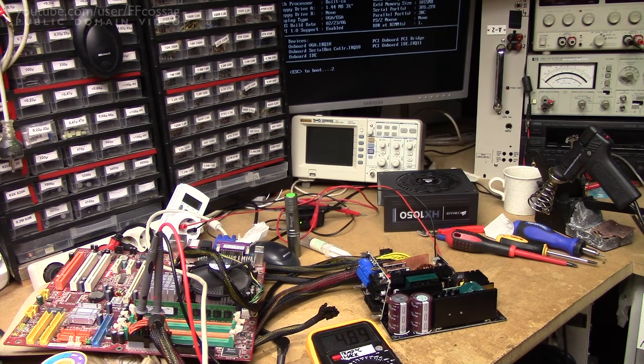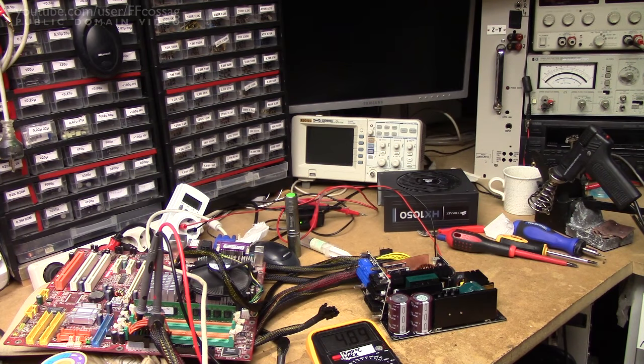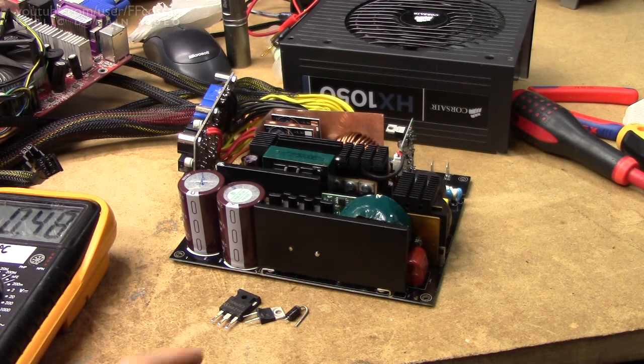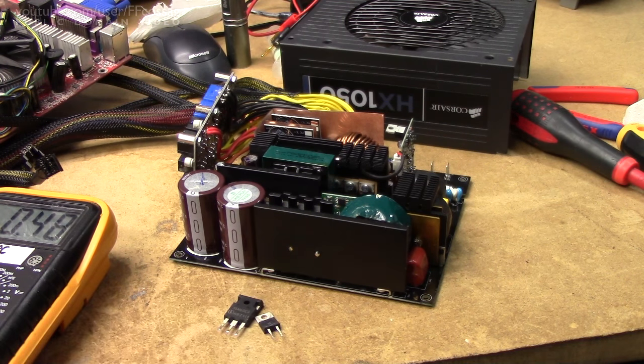Now all I've got to do is order the correct components to put into the power supply, because the diode I put in is just incorrect, and it's not going to run very long on one switching transistor. But that certainly is a fix. So there you go — that's one unexploded Corsair HX1050, and it wasn't too much stuff wrong with it: just three components. I'm a bit surprised, because when you have these guys going bad they tend to eat the switching IC as well, but it seems to have survived, and even all the driving stuff survived. This power supply is certainly worth repairing — I don't have to do anything really super advanced to fix it. Those two MOSFETs are probably going to be expensive because they're very high-end: 100mΩ at 650V. But it's going to be worth it — this was like a $200 power supply when new. Thank you for watching, hope you enjoyed it. Cheerio.